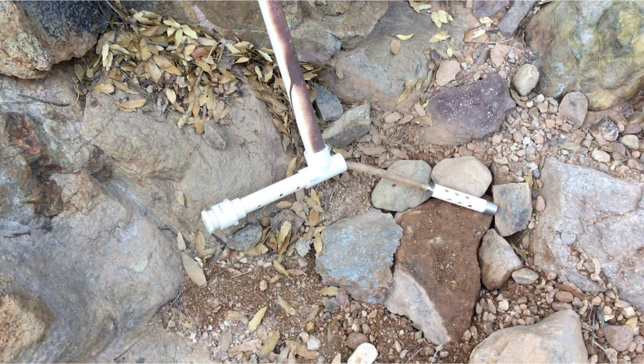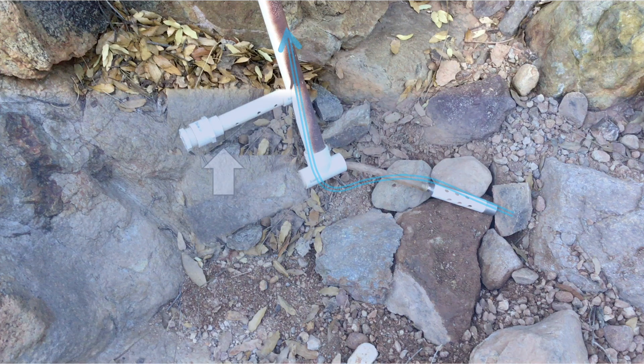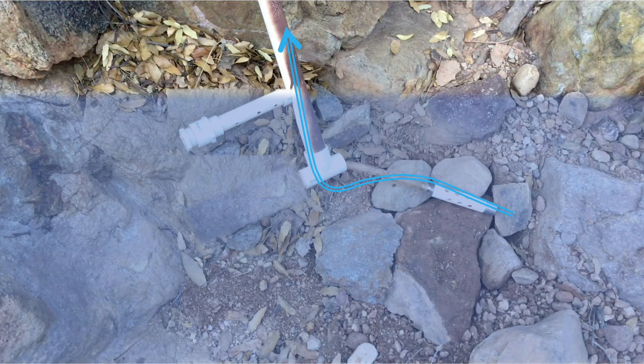One way to minimize that possibility is to lower the elevation of the intake relative to the sensor, so that a deeper flow is needed to trigger the auto-sampler. This can be done by either lowering the inlet or raising the elevation of the sensor. At the same time, increasing the elevation of the sensor can literally set a higher bar for pulling a sample, thus diminishing the probability of a sample being collected.